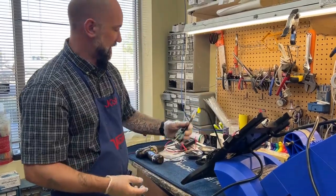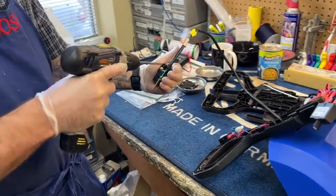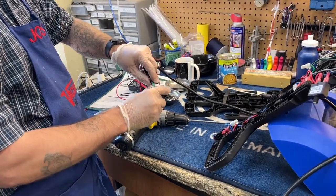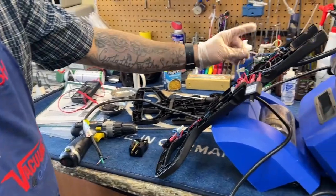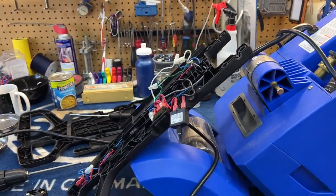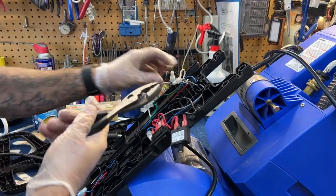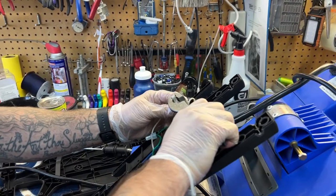So I'm going to take this off — very simple. We got three screws and I will remember my positive and negative where those went. I'll take that off. And then on the other hand, I have my white cord here. I'm going to use pliers to pinch these crimps. If you look at these types of crimps, you can see that they're flattened. If you use simple pliers like this, you can kind of unflatten them.